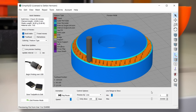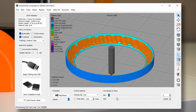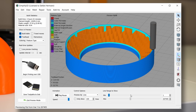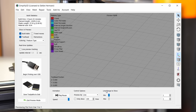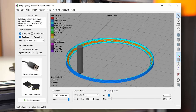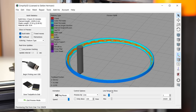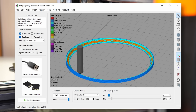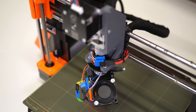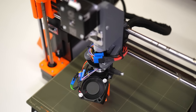With the tilted nozzle of the Rotbot, you omit this issue because you can make sure that you are always perpendicular to the layer and the extruded line. This additional degree of freedom results in G-code that doesn't only reference X, Y, and Z coordinates but also adds a U-value which is the angle of the 4th axis. All of this leads to beautiful non-planar print moves where all four axes of the printer move at the same time. The prints always start at the center of the conical axis and then slowly grow outwards and upwards. The Rotbot can print completely horizontal overhangs without any support material, which opens up quite some opportunities.